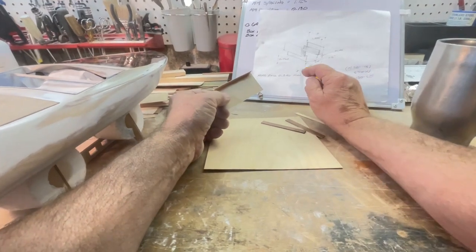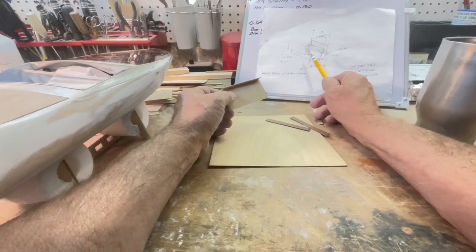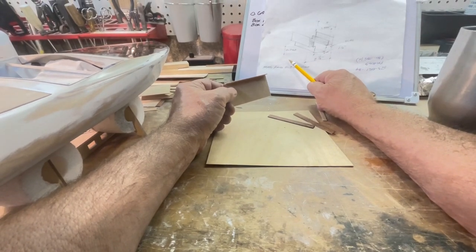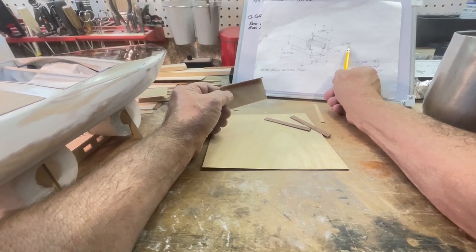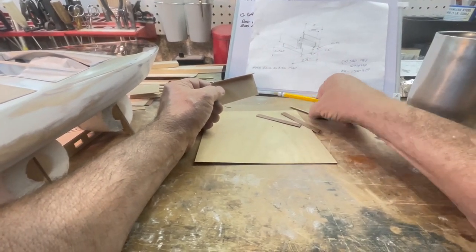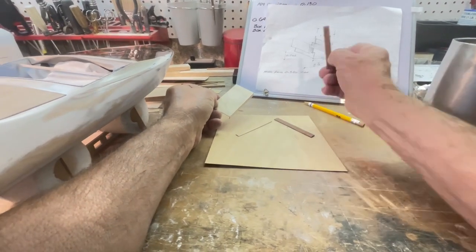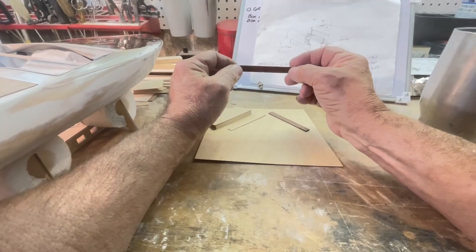So what I'm going to do is I'll build this little three-sided contraption and then cut these, we'll call these the wings, that I don't have a dimension on. 45 hundredths of an inch wide and 3 inches long. So they'll be a little wider than this, and this will sit down on it. Then these are the frame rails that the motor mounts will go on. This is going to be the last thing in.